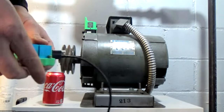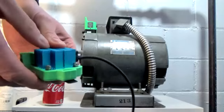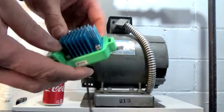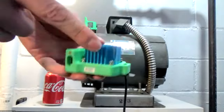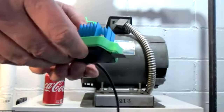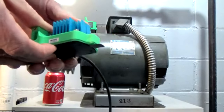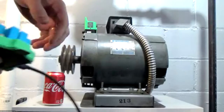Our power source for this is this thermoelectric generator. That's the primary power source. We have another one I'll show you in a moment for solar. The core of this is something called a Peltier device. It's two pieces of dissimilar metal, so you get this side warm. These fins are here to exaggerate the natural temperature difference that's already there. This is the cool side. And once we have a temperature difference of about 15 degrees Fahrenheit, there will be enough electricity flowing out of this wire to power our sensor.